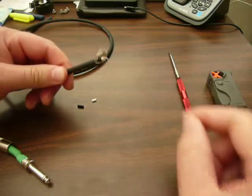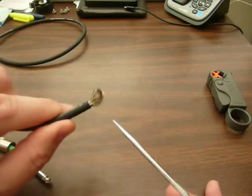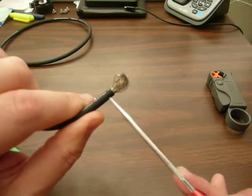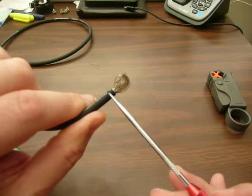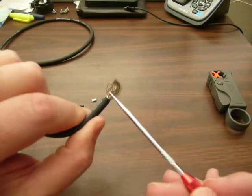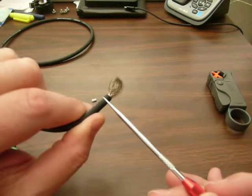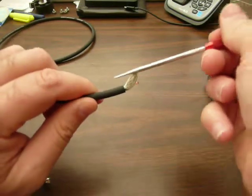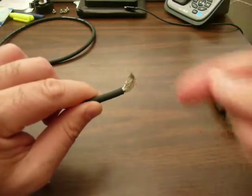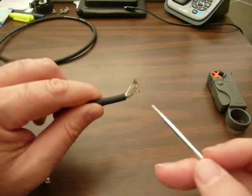What I've done is stripped away the end of the cable. This particular cable, like a lot of cables, has an outer conductor after you peel back and strip off the outer casing. You'll notice that the inner shield is woven. This differs on the GEPCO and many cables from what you'll find on Mogami. Mogami has a spiral wrap — the outer conductor is wrapped in a single direction — and that actually makes for easier handling when you go to make cables.